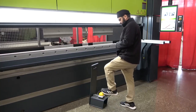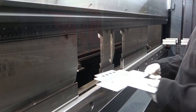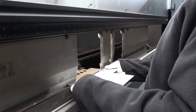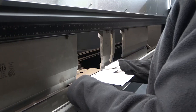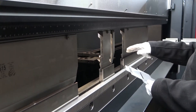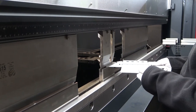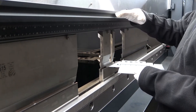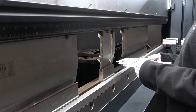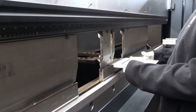To resume the cycle, I just reset and initiate the cycle again. After the machine stops at the mute point, I can go in with the job, make sure it's placed in the right spot, and then use the foot pedal to finish the bend. As I finish the bend and come out to turn or flip my job, the axes already move to the next bend and are ready to go — the ram has also moved down. On a hydraulic or hybrid machine, the ram would still be sitting at the top and I'd have to hit the foot pedal to bring it down to the mute point. That's the advantage of a Safan machine — the machine always waits for the operator, rather than the operator waiting for the machine.